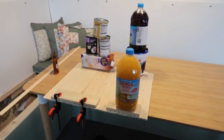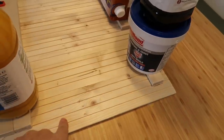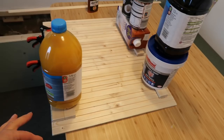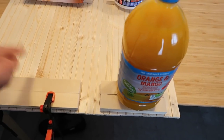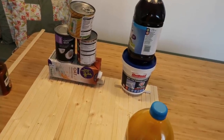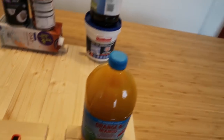While the PVA on the worktop has been drying, what I've done this morning is make a door. We're just using up all the leftover scraps of wood - these were leftover bits of tongue and groove. This is the back side of it. I've cut them to shape, sanded all the edges, glued them together along the tongues and the grooves. These cross pieces are now glued on to strengthen the boards altogether, with gaps for where the door closes and we've got cross members on the carcass of the kitchen. Anybody else use whatever you've got lying around the house to hold down bits while you're waiting for your wood glue to go off?